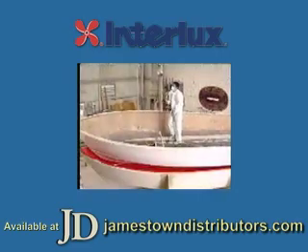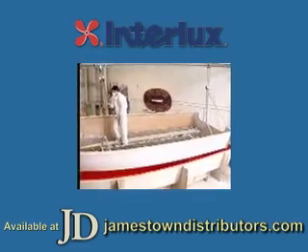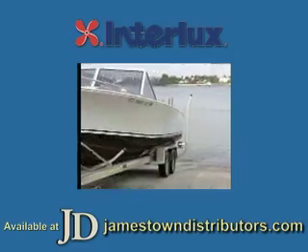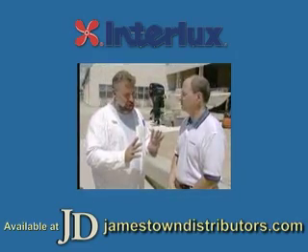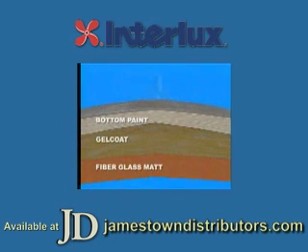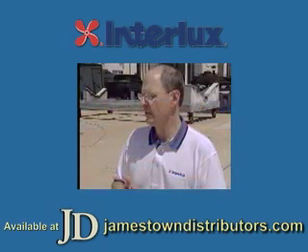Whenever you put a boat into water and it's fiberglass, a gel coat can be porous in nature and it can absorb water. But when you haul it back out, often times the water goes right back out through the gel coat and you never have a problem. But a lot of times what happens is blisters form. In a perfect world, you wouldn't get water absorption in the hull. What's really happening is you're getting water accumulation in the hull, and there can actually be wicking that takes place within some dry fibers within the layup of the hull.